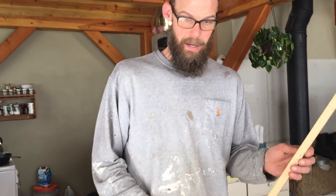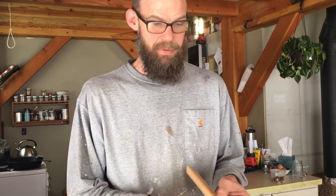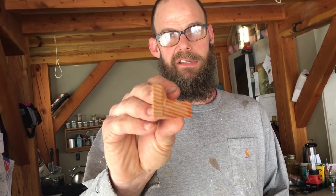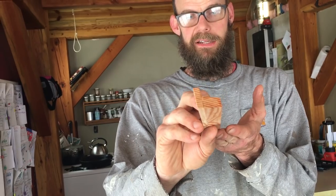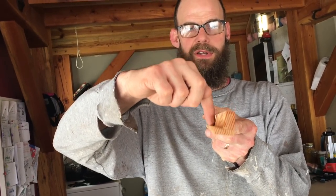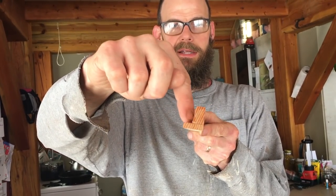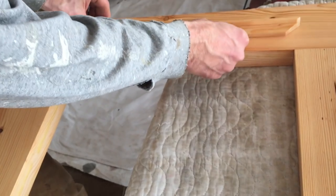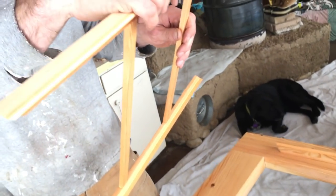So I will still have one permanent side of this glass stop, and this is the shape that I came up with that'll look nice, give lots of bearing surface for the glass, but also gives me an opportunity to drive a little tiny nail right in the valley there, and that's what's going to attach it to the door. That goes there, that one goes there, and this goes in this way.